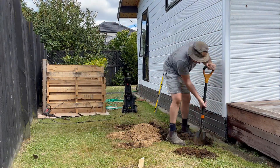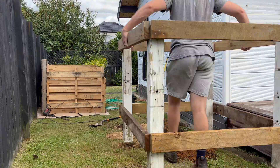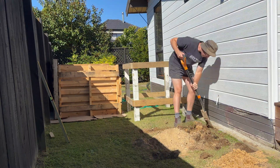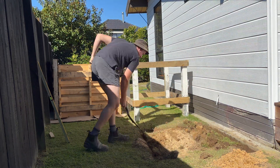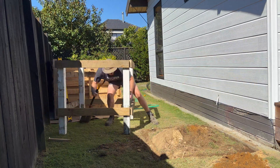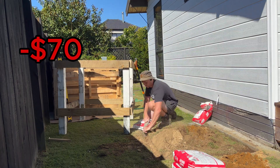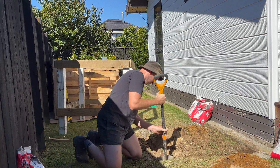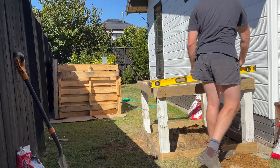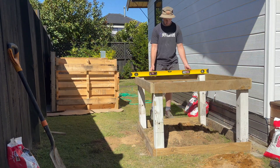I used the 300mm peg here to roughly measure the holes were at the right depth before coming back the next day to concrete the frame in place. I spent a bit of time digging out the grass underneath the edging to get it below the surface. I had planned to use a bag of concrete per hole, but only ended up using three quarters of a bag, so a total of 6 bags across the 8 holes, which cost roughly $70. After that I added some concrete into the base of the hole so the post will be sitting on concrete and not soil, and to help with getting things level. I found the best thing was to just tap the high corners down progressively with a sledgehammer.